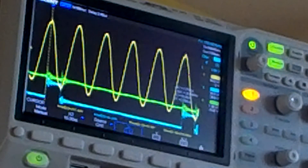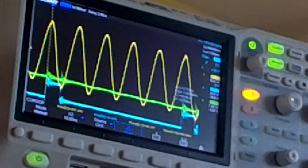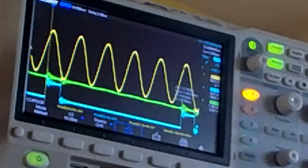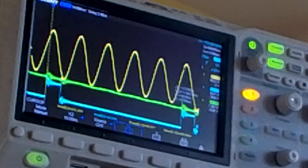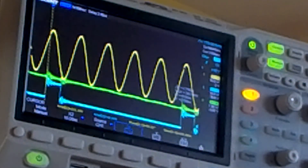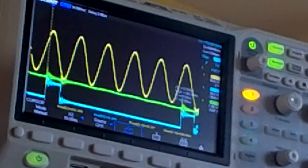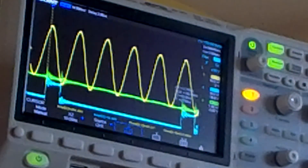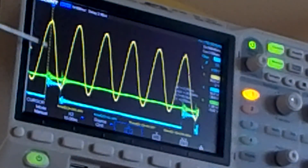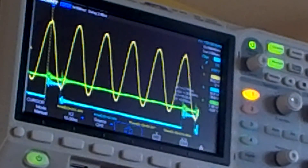We see we are back at the top. If we now go higher in frequency - we are now at 179 kilohertz - then you see we are coming to this side of the pulse and our voltage also for the sine wave goes down. We also see that the amplitude goes down, so the most optimum position for the rising edge of our pulse is over here.